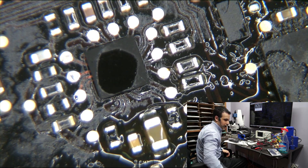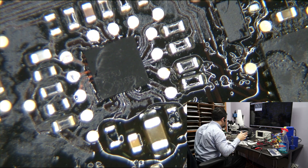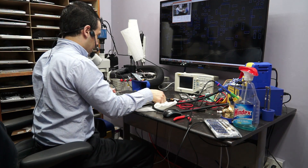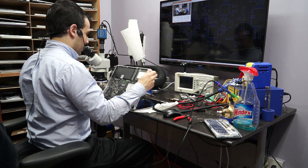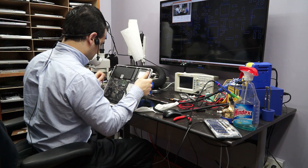Running at setting 8 on the hot air station, which should actually be burning the chip — and it still wasn't melting the solder. I need to replace the heating element in my FR801. I keep saying I'm going to do it, but the real world keeps getting in the way. I'll only make the time once the thing stops heating entirely, which means I'll have a lot of spare time — so I really should do it immediately.